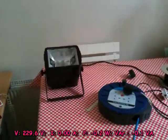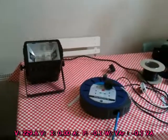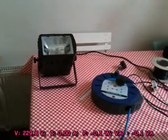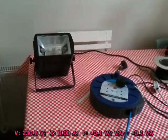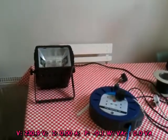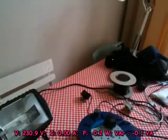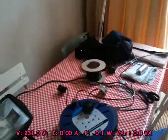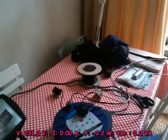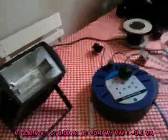What we're going to do is look at this HID high intensity discharge lamp warming up and watch the power change as the lamp warms up. It's got quite an interesting behaviour and you can see the actual fluctuations in current change with visible fluctuations in the appearance and the colour of the light.